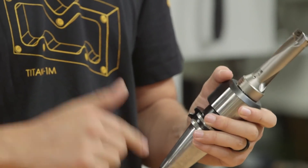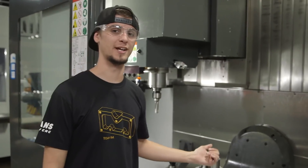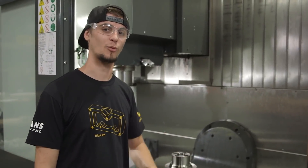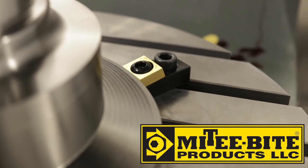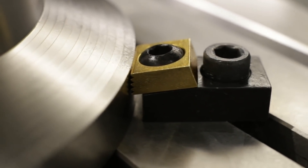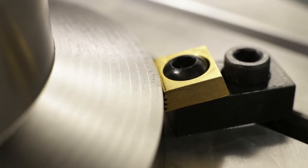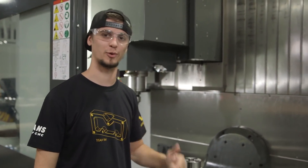Now that we have our .984 drill, we're going to run it in this titanium. I'm holding down this titanium rocket part with four Advan Edge Mighty Bite clamps. These are really cool because they slide into the table and lock down, so you don't need a vise or anything else — they just pop right in. Since they're at an angle and have the cam lock on them, they put 4,000 pounds of force in and down, which holds this perfectly for drilling.